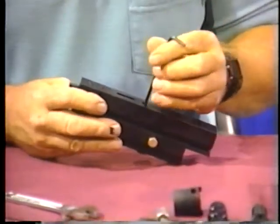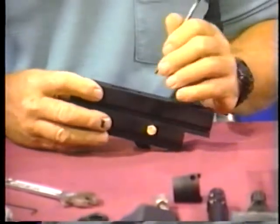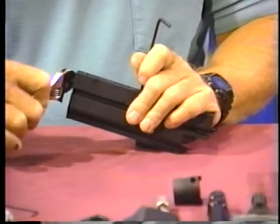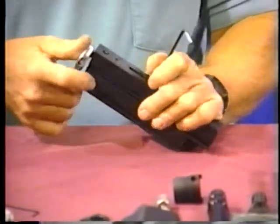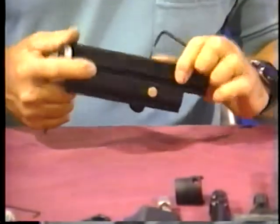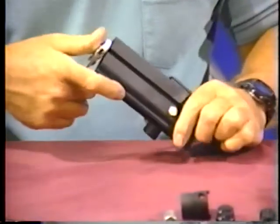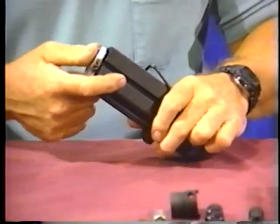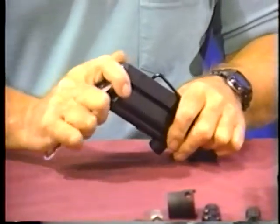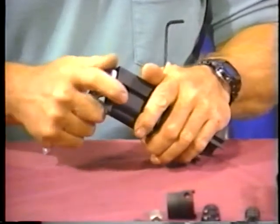and you can actually move the valve assembly by shoving it from one side to the other. You want it in the center. You put the Allen in there like that, tighten it up. Okay. Sometimes you got to back it off. You don't really have to use a lot of muscle to tighten this because it is an O-ring seal. You want it snug, but you don't want to rip the threads off the body.